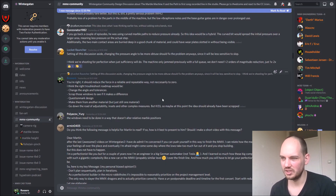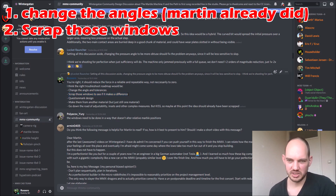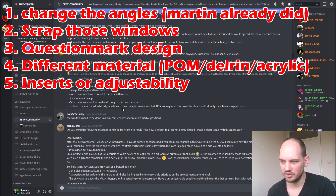I think the roadmap to success — if you can call it that — is firstly to change the angles and maybe try the tolerances. If those tolerances don't help, scrap those windows, especially the ones in the front but also on the side, to add more rigidity and make it stiffer. Then I would jump to the question mark design. It needs a redesign, but the module itself can be smaller because it stacks on top of itself. The flex in the front wall won't matter as much because extra flex means the marble gets pushed through more instead of less. Then you can make the complete unit out of a different material like POM, and go down the road to having adjustable zigzags or inserts or other complex measures — but I would say keep it stupid simple.